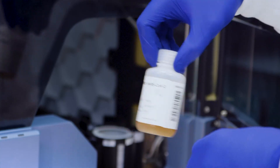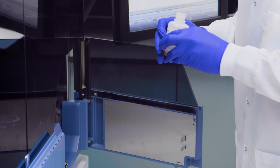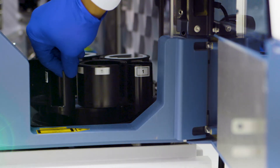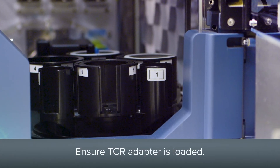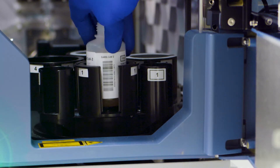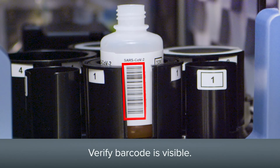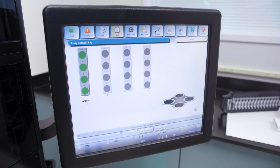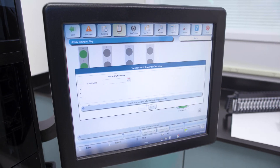When the reagent rack is successfully loaded, the TCR carousel stops spinning — this may be delayed if reagents are currently being pipetted. Once the TCR carousel stops, the TCR door unlocks. Open the TCR door. Mix the TCR bottle by gently swirling, avoiding foam. Remove the cap and inspect for foam and bubbles. The TCR position must match the loaded reagent bay lane. If necessary, rotate the TCR carousel to ensure proper placement. Ensure that the correct TCR adapter is loaded into the appropriate TCR carousel position, then insert the TCR bottle. Press down firmly to ensure the bottle is fully seated. Verify that the barcode of the TCR bottle is visible through the slot of the cup. Close the TCR door. The TCR carousel will start rotating and the system scans all TCR carousel positions. For new kits, after the TCR bottle is scanned, the Supplemental Reagent Information window opens for the operator to enter the reconstitution dates.